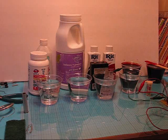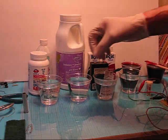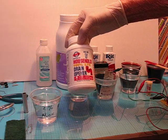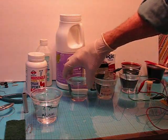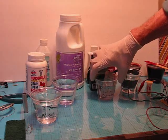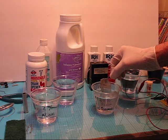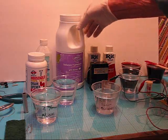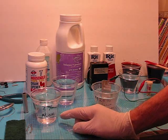This is introductory level. Like anything else, it's a hobby you can start off slow and learn as you go and become better. Here's what's going on: this is a 2% solution of sodium hydroxide, which is simply drain cleaner — 100% dry. And this is a 20% solution of sodium bisulfate. I already have the cathode in here — it's just a chunk of scrap aluminum, pretty easy to find.